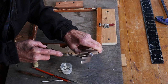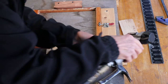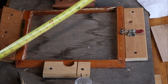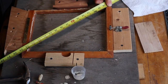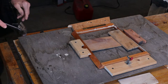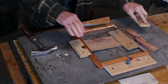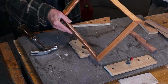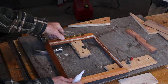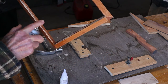You're going to see me use a pin nailer — a headless nailer. I know my thumb's in the wrong place, but I trust the gun. These are short little pins, only three-quarters of an inch. After releasing it, I'm going to put a little CA glue in the corners. There is a little bit of openness, so this will run down and tighten up that joint — what the PVA glue didn't do, this will do. A little bit of activator and that one's done.